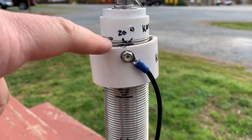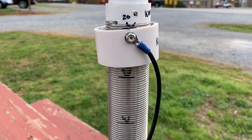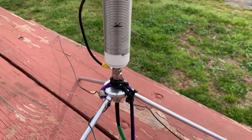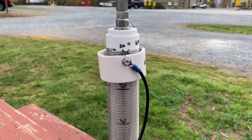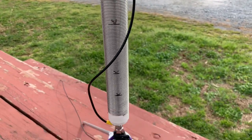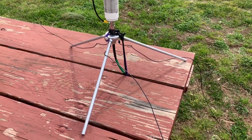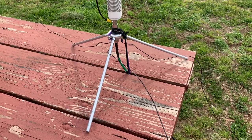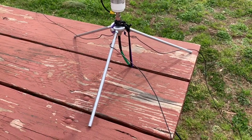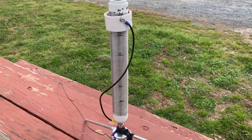I'm taking the measurement from the top of the shunting ring. I'll set the top of it at each of these little marks for changing the band. I do have all three of the 33-foot radials out, kind of randomly placed — they're not all exactly 120 degrees apart but they work okay.